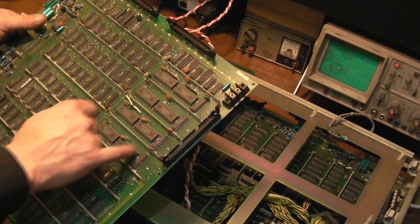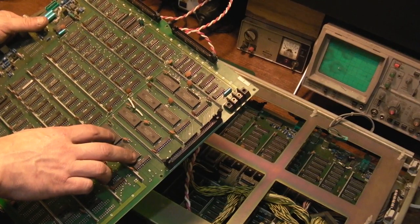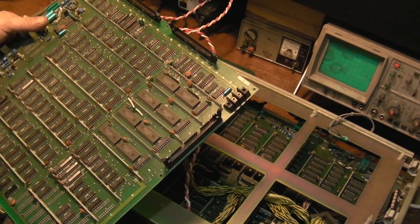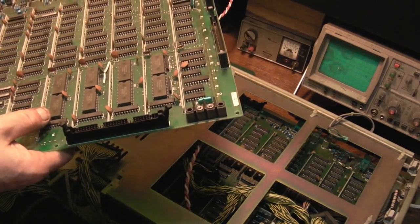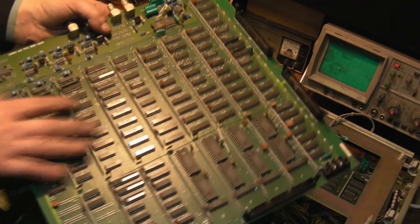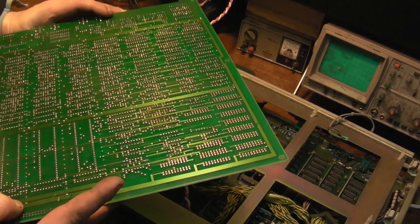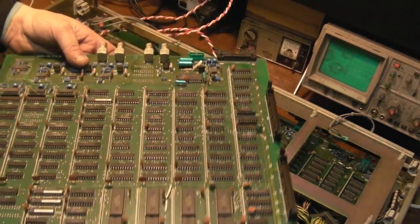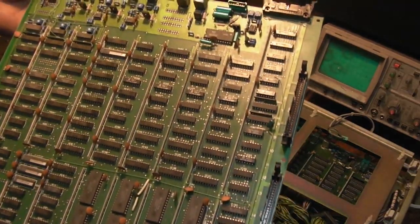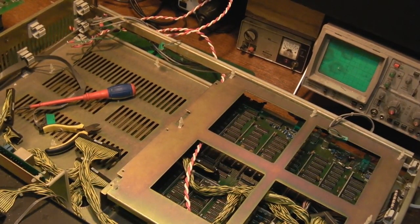They're 256k SRAMs, those. So that's 2 megabytes of RAM, is it? That's 512k, 1 megabyte. Yeah, 2 megabytes of RAM it's got on board. That's about it. All this is just glue logic, it's just 74 series logic ICs. I'm guessing these are only two-layer boards then. Yeah, I think they are. There's nothing really exotic in the manufacture of this thing. But I suppose when you can make the boards this big, you might as well go with just a two-layer design. It keeps the costs down.